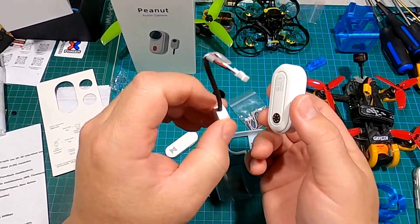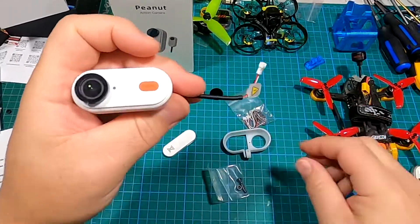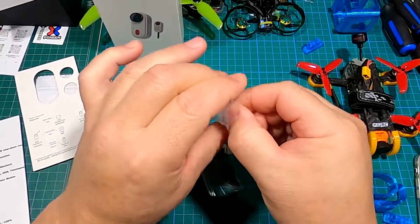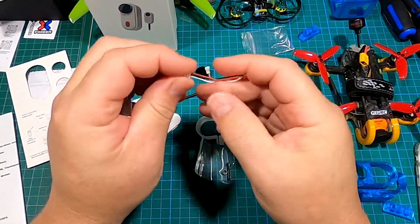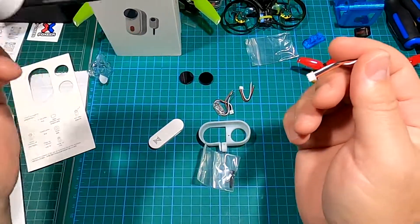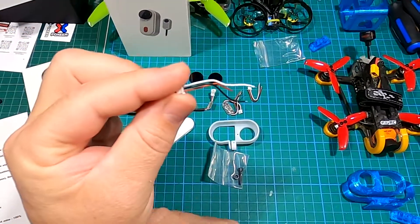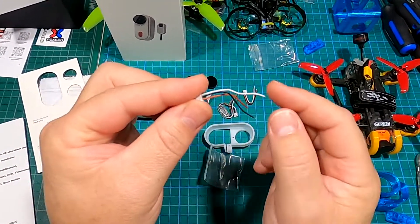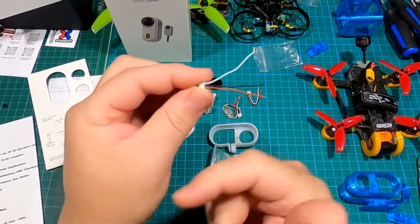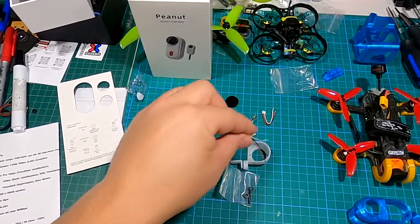Alternatively, what you'd want to do is use the included wiring harness that goes on, and then you can connect it with the included connectors. It comes with a bunch of wiring — you take one of these plugs and wire it in so you can move it from one quad to another quite easily. You'd hook it up to your flight controller at five volts, because it runs on five volts. Your negative and this line go to any spare UART, and then you can set it up to control the on/off via a toggle switch on your radio — that's pretty cool.